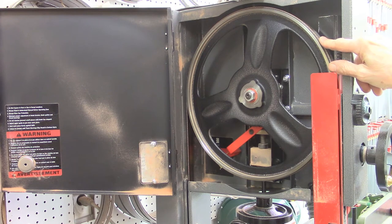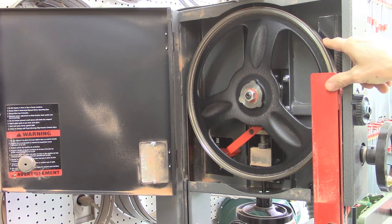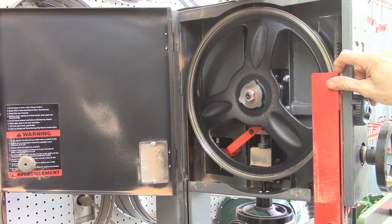This may be enough to solve a minor problem. However, my preference is always to run my bandsaw blades centered on the tires on the bandsaw wheel. I prefer this because my blades are always centered on the tires, even when I change between different widths of bandsaw blades.